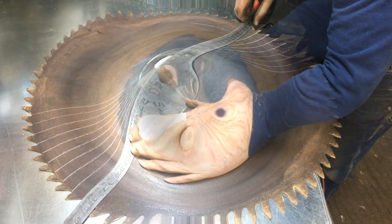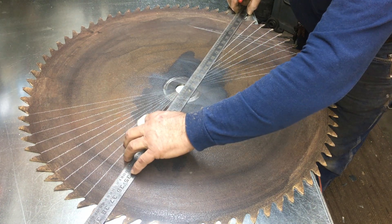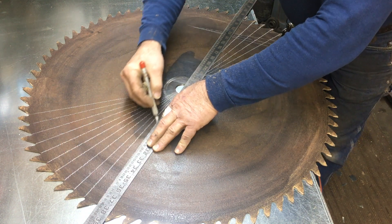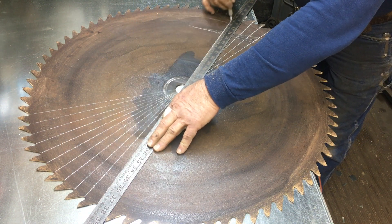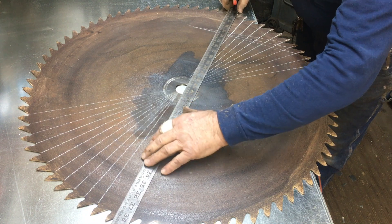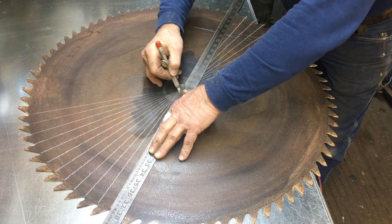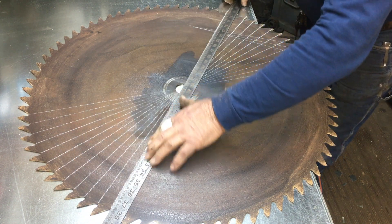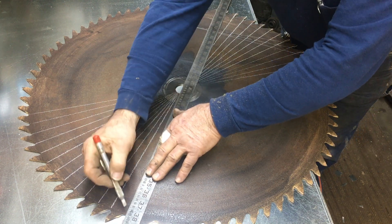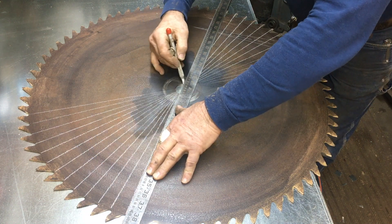This is an old-time blacksmith way — not the tried and true proven way with all the high accuracy of sharpening shops of today. But this is how the old-timers did it to get by, and this is how I learned from the old man. The big difference I'm going to do: instead of using my lathe by hanging the blade horizontally in line with a half-inch gumming wheel — where you support it with a chain through the arbor, hold the blade horizontally, and slowly swing and index it into and out of the rotating gumming wheel to adjust your gullets and shape the backs of your teeth — we're going to be using that Foley Bell Saw sharpening system, which is somewhat more modern.